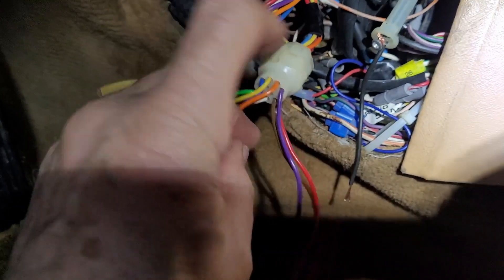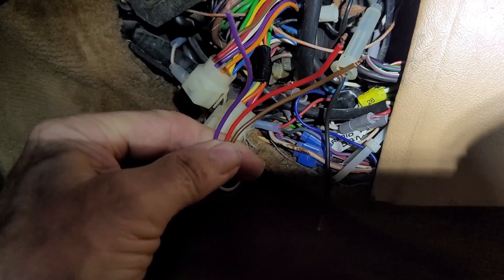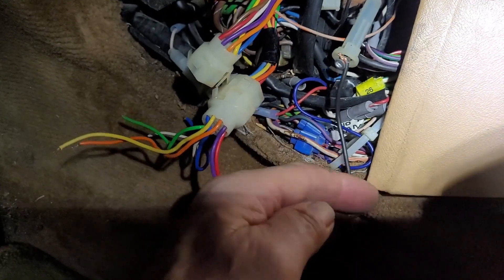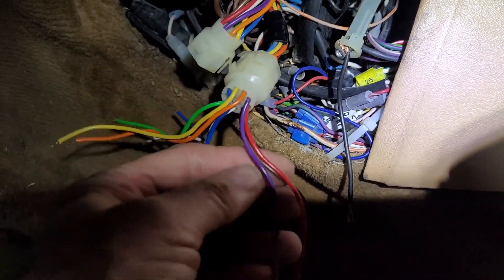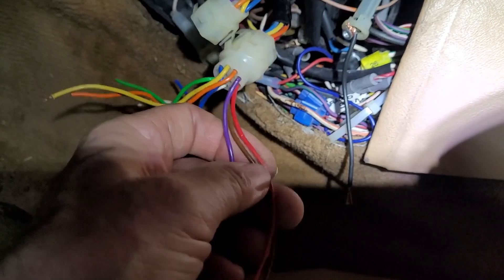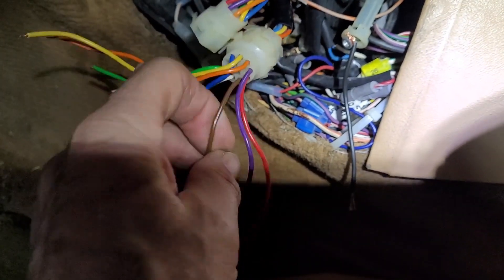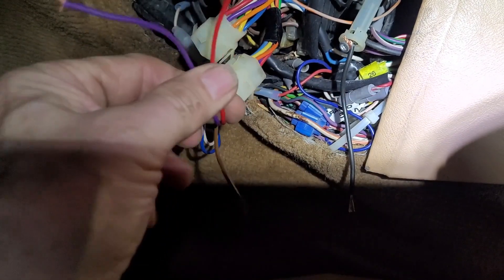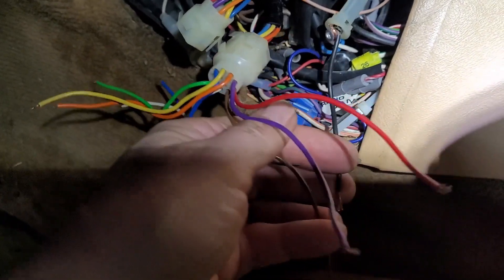What we want are the purple-colored wire, the red wire, and the brown wire, as well as a black wire which goes to the fuse holder or to ground. The red and purple wires drive the servo motor. The brown is your power wire, and the black is ground.